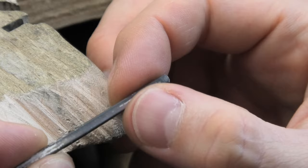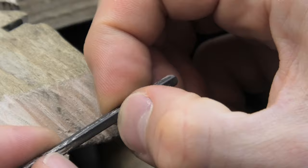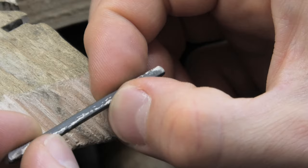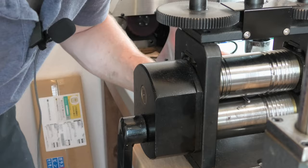There's a mistake I always make — I always mill out too much distance so the ring size always gets massive. So I'm just going to try and keep it that far from the end, just mill out about that much, then the whole shank should be about that long with a thinner bit in the center. But first I'm going to squeeze it one way to get the height and then start working in that little middle section.